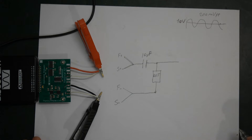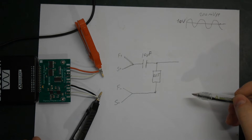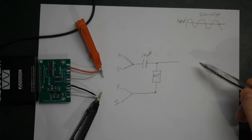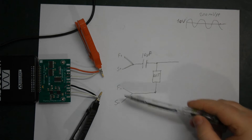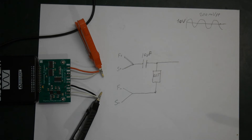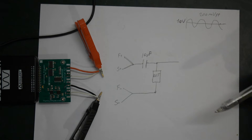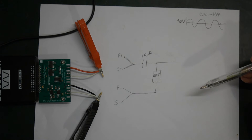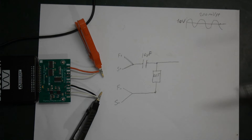It's quite important that whatever we use to supply the external bias voltage is isolated — it cannot share ground with our impedance analyzer. It's also important that it should be a linear power supply; you don't want switching noise to interfere with your measurement.